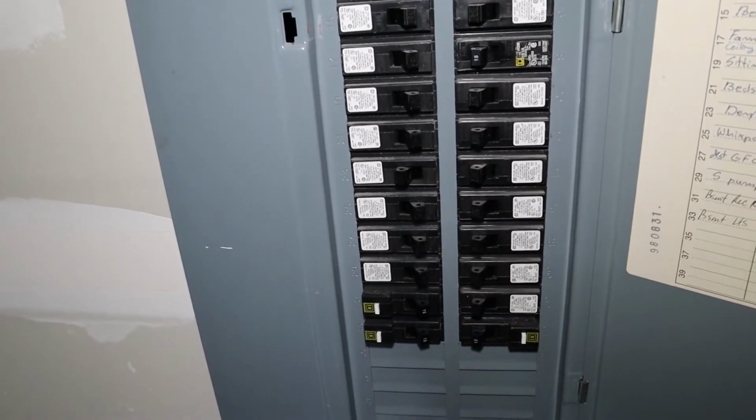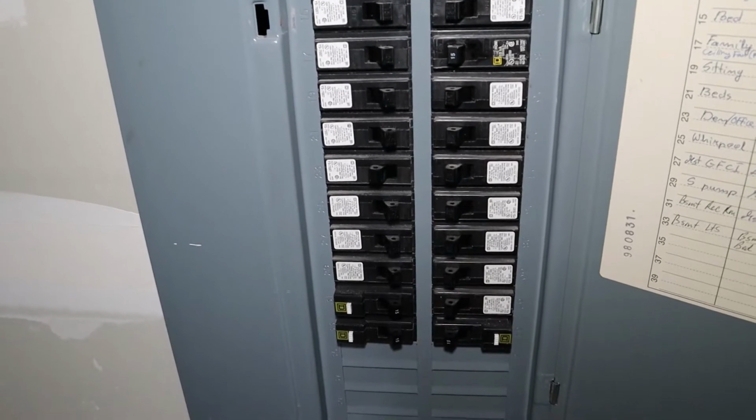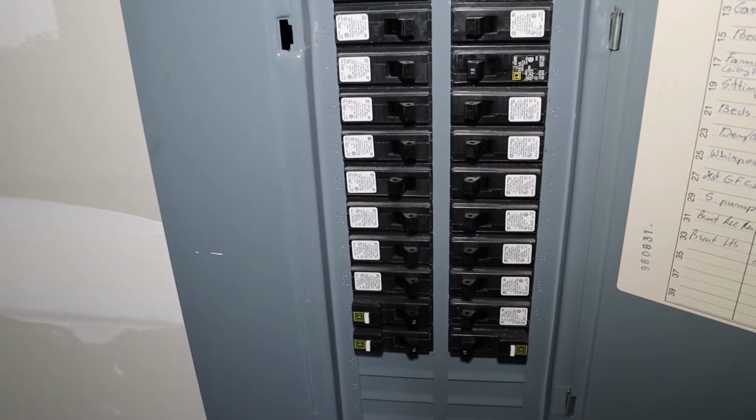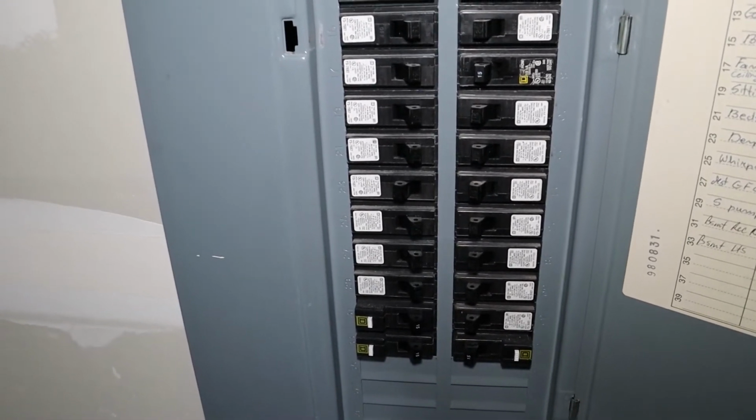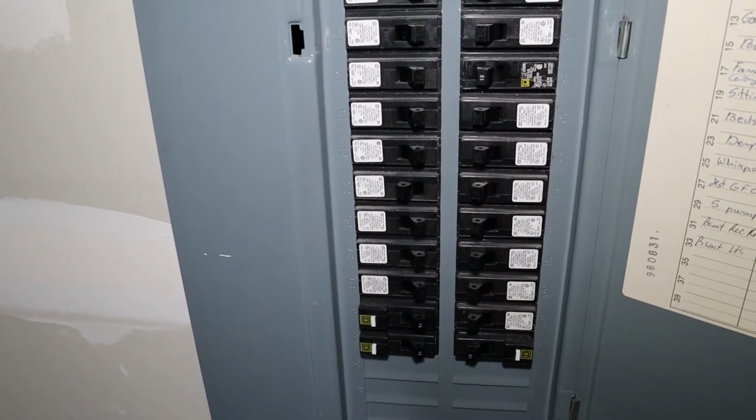And then you go up, test with your electricity testers, and make sure you're all good. But guys, this is an important step. So come to your breaker, turn off your electricity, and make sure it's not running to that room and that fixture anymore.